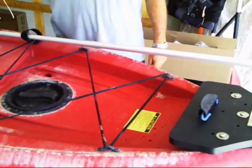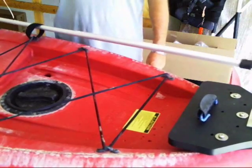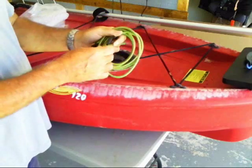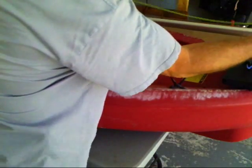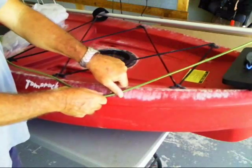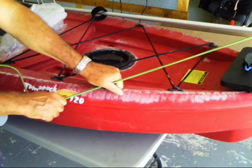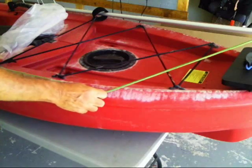You're not going to go anywhere, and you can still use this to go back and forward. The lifting system comes in the package — it's a bungee cord. We'll be putting a pad eye here, and the whole idea is when you have the pad eye in, you can pull it and it lifts the motor right out of the water. Our first pad eye is going to go about here and our second pad eye is going to go up here.